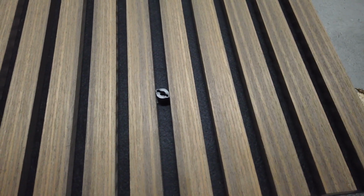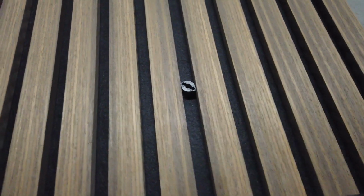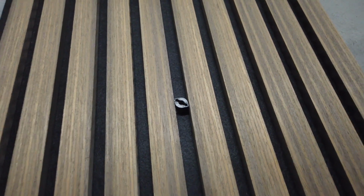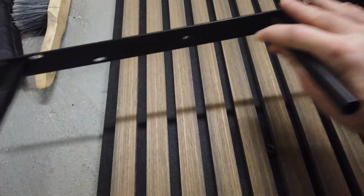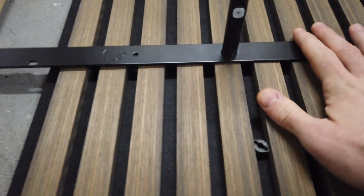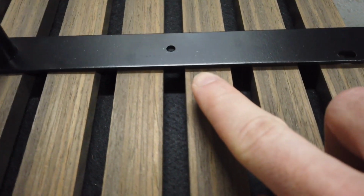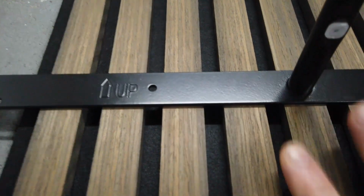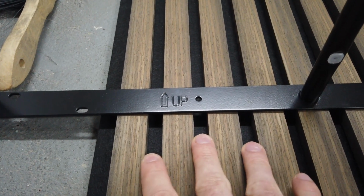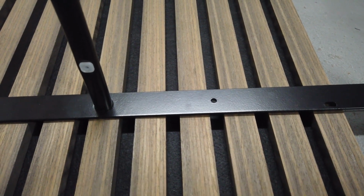The second assumption to test for this whole concept is if the slat wall units actually line up. I will be making an adapter plate, but I'd like it to be as close to the wall as possible. So I went ahead and bought a slat wall. Most slat walls have an inner metal frame, and that's what this is. So the idea here is, do any of these mounting holes line up with these slats? And thankfully, the one that I bought happened to line up at a nice interval. So I can get at least 2 direct mounting holes, which means I can keep this very tight to the assembly. I'm gonna put a handful of additional fasteners in the assembly. The goal there being just to distribute the force a little bit nicer and give the shelf a higher overall capacity.